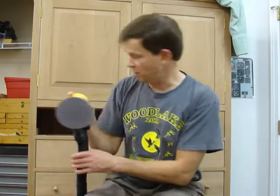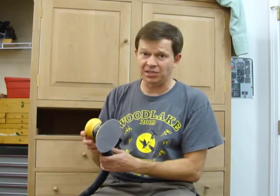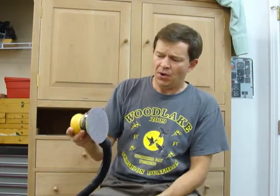You could use a cabinet scraper too as well. The lion's share of the work I'm doing now, sanding the drawers, is done with this Mirka sander. It's a direct current motor so the AC power is turned to DC power. That means the motor can be very small, it has a lot of torque, and with the lower profile it's very comfortable to work inside a cabinet. I can get in here into the side of this cabinet and sand inside — bottom sides of frames — where I couldn't do that with a Bosch 5-inch random orbit sander. It just couldn't get in places like that, and it was top heavy.